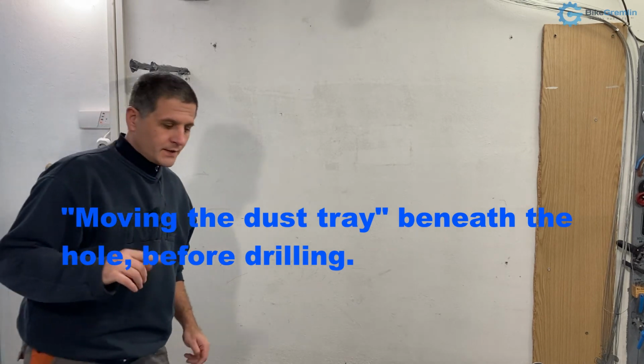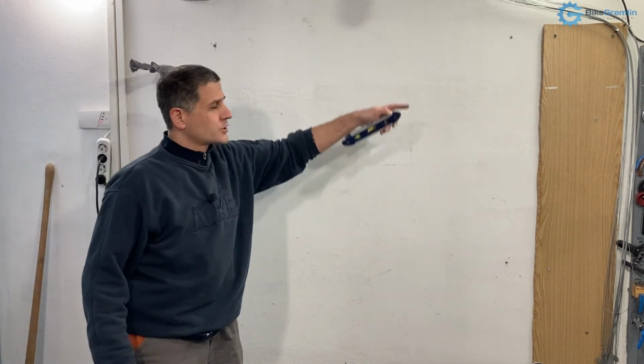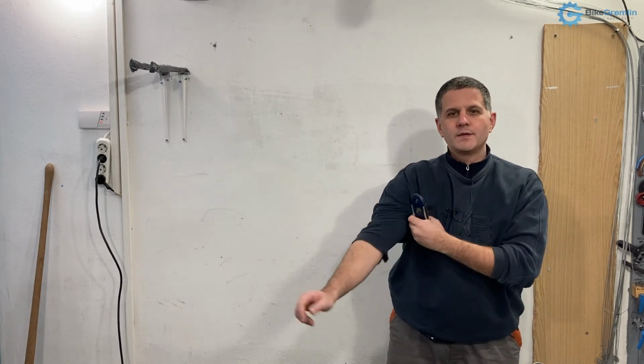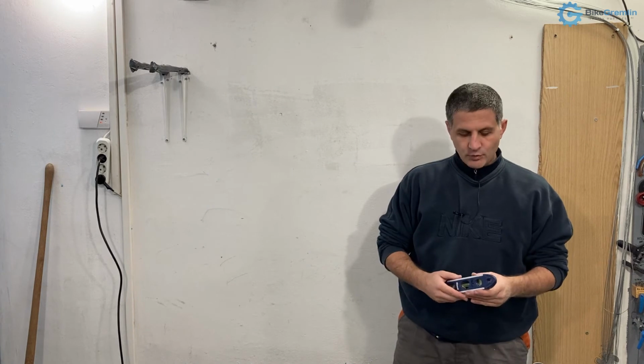Now, why didn't I just use this along with some ruler and measure everything, all the other holes using that? Because in my experience that can be very tricky, and you can relatively easily make a mistake. I prefer to use whatever it is that I'm mounting with its mounting holes as a sort of a guide for marking the holes, and that's what I did on my own now without an assistant, in a bit clumsy way, but I think it will work fine.